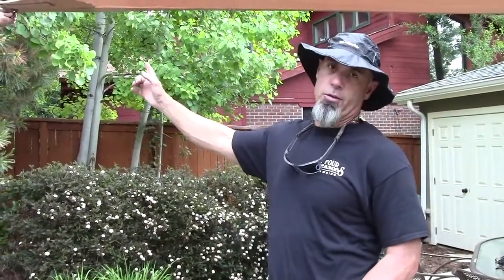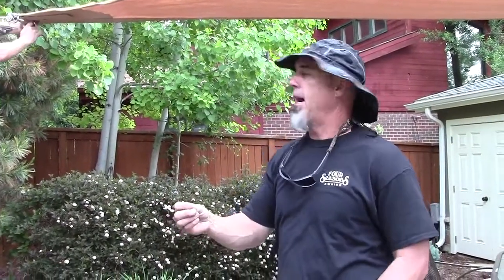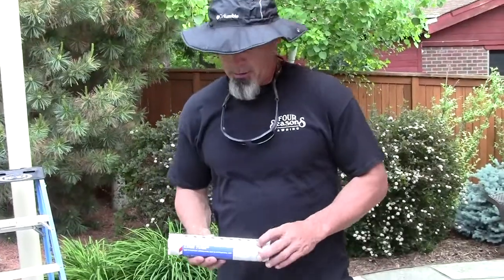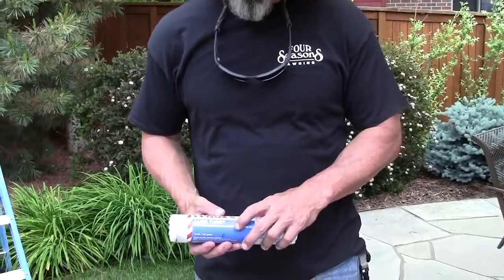Just as a little tidbit, the nut size on those wire nuts is going to be one of two sizes. It's either going to be a 6 or an 8, so that way you're not having to guess what size socket to find to tighten those up. And you do want a socket, you're not going to want to try to use an open or a closed wrench.